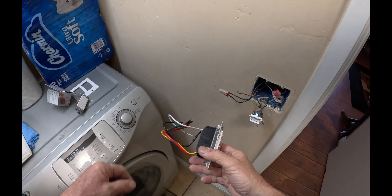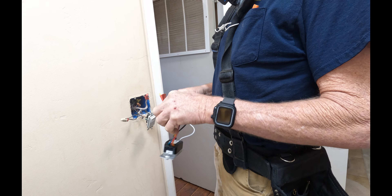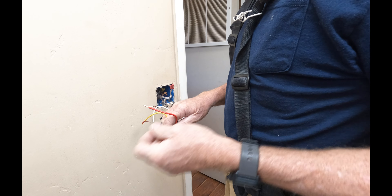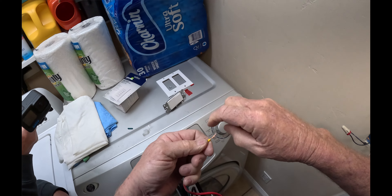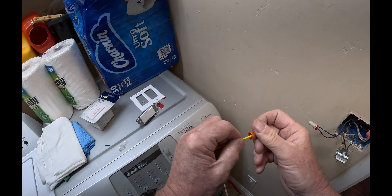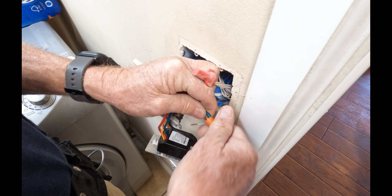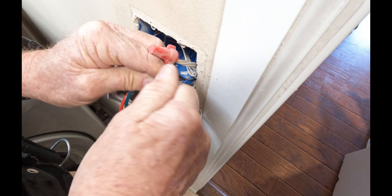I know there's a lot of different ways to wire switches, but with everything needing neutrals these days I always make sure we run the hot and the neutral to the box instead of wiring it to the fan or the light and bringing switch legs down. If you want to do it right and not have a callback, that's what you do. This switch can be either a single pole or a three-way, so this extra wire is for the three-way which we're not going to use, so I'm going to terminate it and put a wire nut on it. This particular switch has a stranded wire — when you're doing stranded to solid you can't twist the same way, just get them together, make sure they're good and tight.